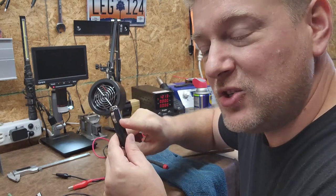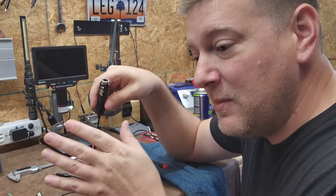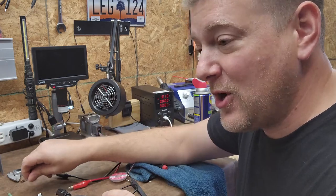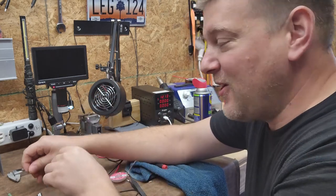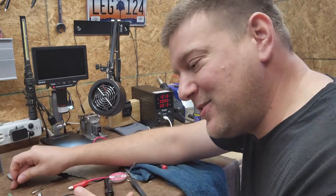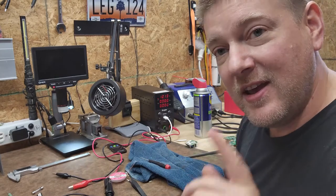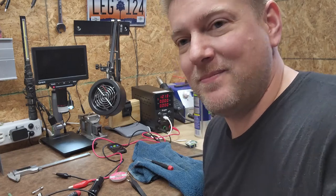Never foil-wrap a fuse if you're going to plug this straight into a 12-volt power source like a car battery, because that's an unlimited amount of amperage — you could melt the device, almost definitely melt the cable, and probably start a fire. DC is no joke; it is the worst type of electrical fire you can get. I do things like this because it's a very contained environment. Just to show you: you can use a regular DC power supply to troubleshoot your device, and things can be fixable even when you think they're beyond repair. Thanks for watching!